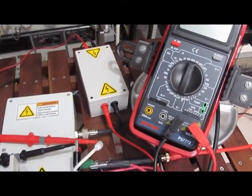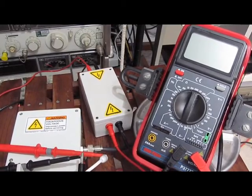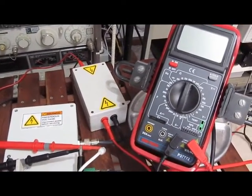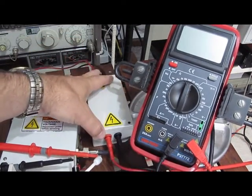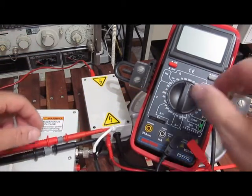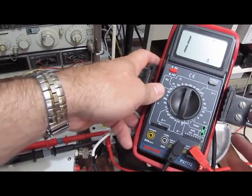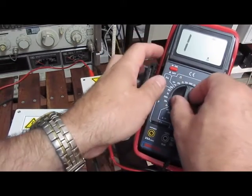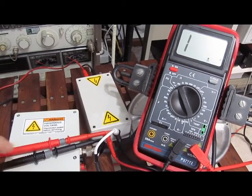So our pile of shame is increasing. Let's try this — this is my Syntec, the P37772. I've tested this meter with DC voltages; I've never AC zapped it. I actually own a few of these — some of them modified. This is a virgin one here. The reason I want to show this is I've got it now attached to our attenuator, and the attenuator with our new probes attached straight to the generator. This meter has no CAT rating — these things may take a couple of kV, but this meter here would never survive this test. I guarantee you that.